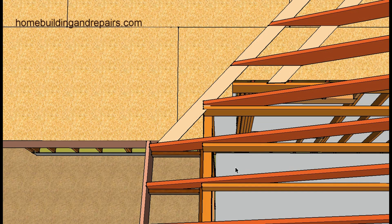On this side where we have the soffit, you can see the little joist there for the soffit. The previous video showed the plywood or roof sheathing going all the way over to here, but this was going to leave a hole, so I went ahead and moved the plywood over and extended this fill board down. It used to stop here — you can go back and look at the other video for more information — but this provides a cleaner look. I wanted to point that out in case you were wondering about that.